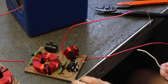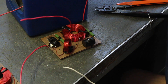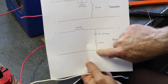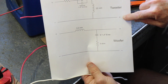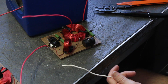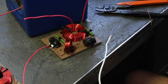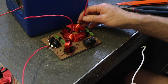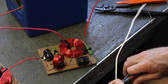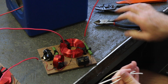The next thing we're going to do is put the negative for the woofer. On the woofer we're going to tie it right in the circuit — tying it right at the end of this connection here. We're running a negative from here right to that contact. Then on the tweeter, we're going to run a negative all the way across because these two parts are connected together, and we're going to run it all the way back to the start — one common that goes all the way back. For now we'll do just the woofer one, which is about the same length as the other woofer terminal. We're going to cut that one off and make a duplicate to go to the other speaker.